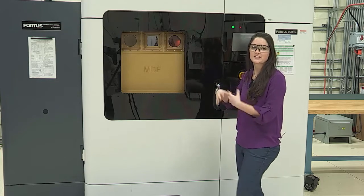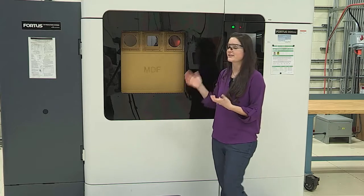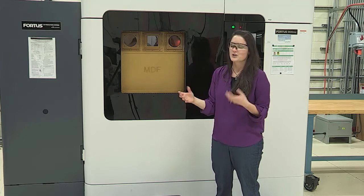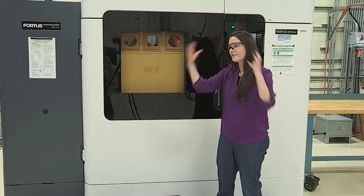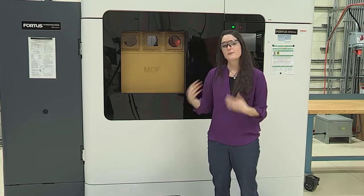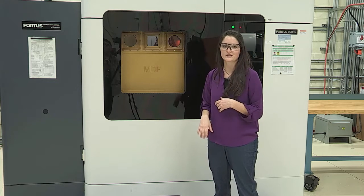Another thing about this machine is that it's actually got a heated build oven — about 200 degrees Celsius inside. For the Department of Energy, we've calculated that 95% of the energy of this machine is to heat that build volume. That's because when you're building something layer by layer, the material is cooling and contracting with every layer. If you don't have a heated build chamber, you're going to get a lot of warpage within the part. On the BAM system, we don't have the luxury of a heated print bed, so it's actually our materials that make it possible for us to print without a heater.